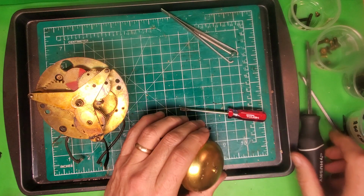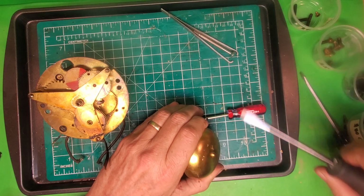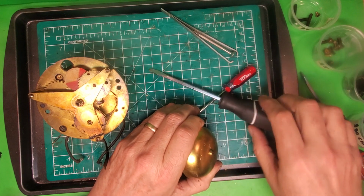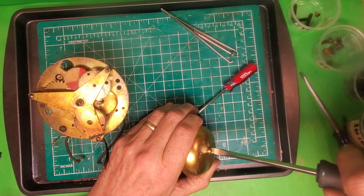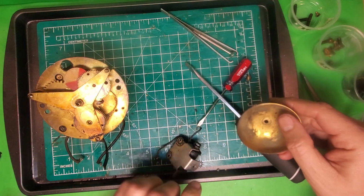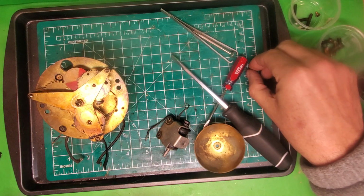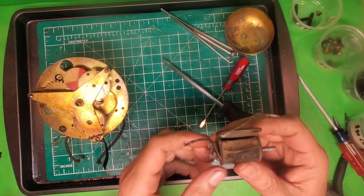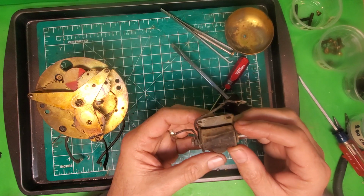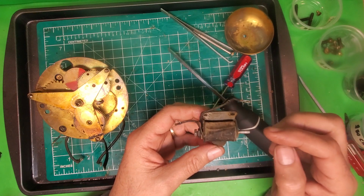then reassemble it. So, taking out this screw right here, in between the bell and the bracket there should be a lock washer, a star lock washer. So take this out. Here's the lock washer that I'm referring to, and I'm going to clean that, clean up that bell. With this, I'm going to wrap this coil with glass tape and then coat it with liquid tape.